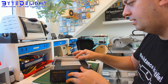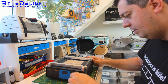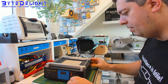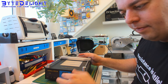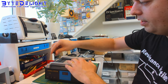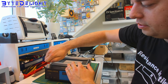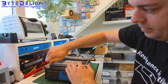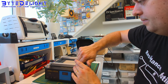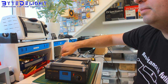Let's get rid of the plastics. I see what the front screws are for — they're for holding the board in place. So you can see the heating element here in the middle. High temperature warning. Here's the control system: actual temperature and set temperature. Actual temperature, of course, is more important. This is the setting for the temperature. It's a good quality switch, better than the soldering iron switch I recently bought.